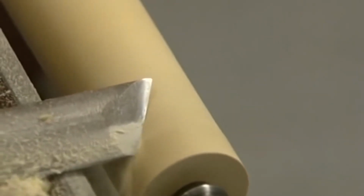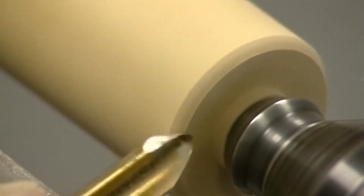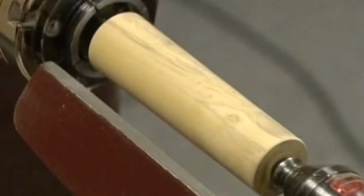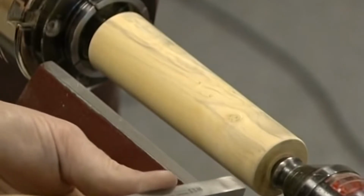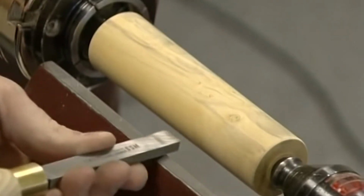After the boxwood has been roughed down, round off the corner of the cylinder with a spindle gouge. This is important because a sharp corner will impede the clean striking of a thread. Once prepared, we can commence using a thread cutter. Before doing so, we need to master the cutting action of the tool. As with most things, there is a very definite technique involved.